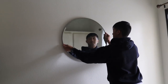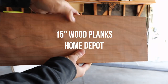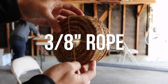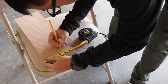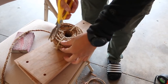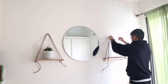I found a circle mirror from Target and will be using it as the center of my wall display. Next to the mirror will be two hanging wooden shelves that we DIY'd ourselves. We bought two planks of wood from Home Depot and had them cut to 15 inches in-store, and also picked up rope from Home Depot. This DIY is so easy and cute — mark about an inch from each corner, then drill four holes large enough for the rope to slide through. Cut two long pieces of rope; we didn't measure exactly until we tied the knot and saw what it looked like on the wall, since the length really depends on your design.